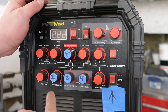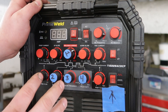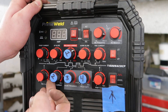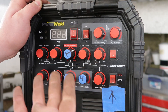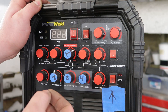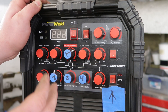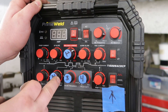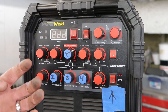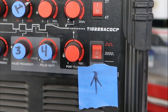For base amps, in most cases I like to keep this all the way down as low as it'll go, because when I use it I want to freeze that puddle as much as possible. If it's going to be in the 50% range, a lot of times I can do that on the fly just using the pedal and adjust for that. When I really want that puddle to freeze up is when I'm going to be using the pulse feature, and I'll run that almost all the way down. That can vary between the materials you're using — some materials you don't want to fluctuate that amperage as much.